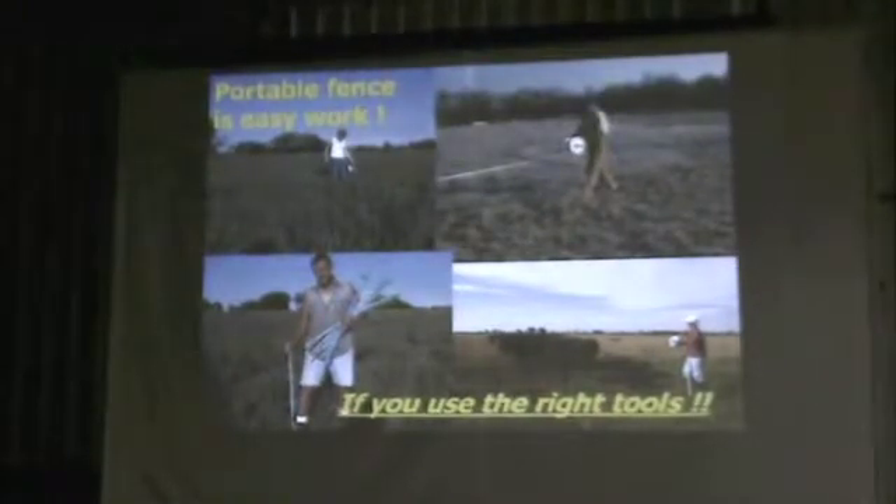In the tank itself, the water's cooler. The animal starts drinking, hot water flows in, but initially it's being diluted by the cooler tank water already in the tank. We were using just a three-quarter inch pipe, and it's up around 100 feet of pipe to have one gallon in a three-quarter inch pipe. So if you have 1,000 foot of pipe out there, you would only have 10 gallons of water in the pipe. It flows into the tank and is being diluted shortly after — then you've got cooler water coming in again.